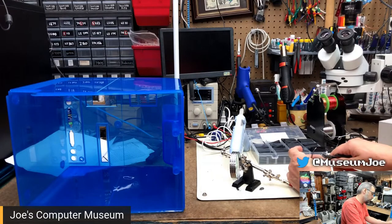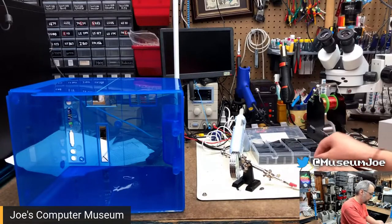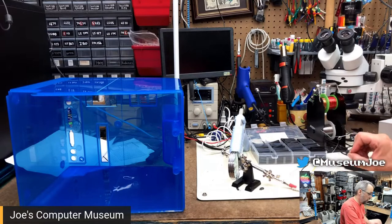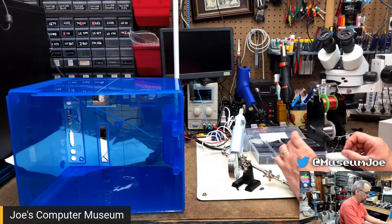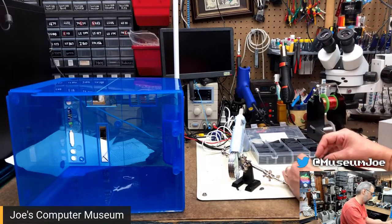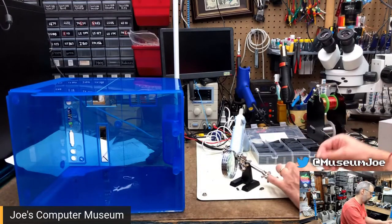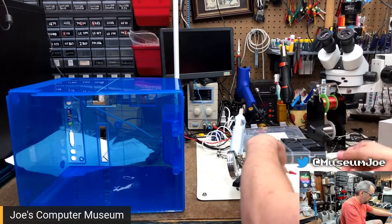I'm going to cut these a little short because they're a little bit long. Now we solder this on here. But before we solder this on here, I want to put a larger piece of heat shrink across all of it. So we'll do this one, and we'll get that ready, because then we'll just jacket the whole thing all at once. Right. So now we pre-tin this lead,